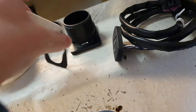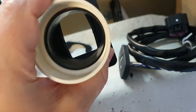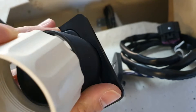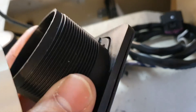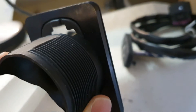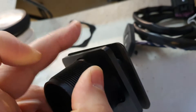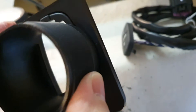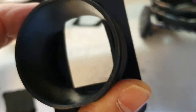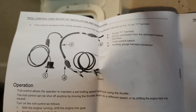The specific challenge is that the 56mm dimension is almost at the edge of this frame. When you put the nut on, it can end up outside the frame — so you'll need quite precise drilling. I would personally prefer a wider frame with fewer drilling problems, but for space saving this is the solution.